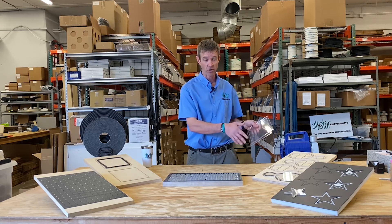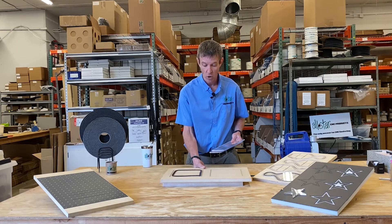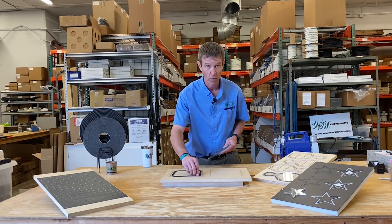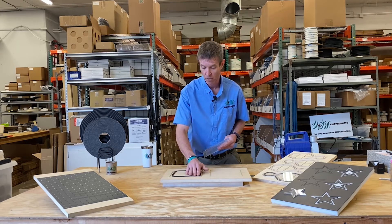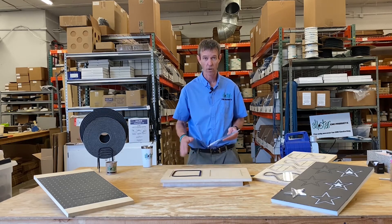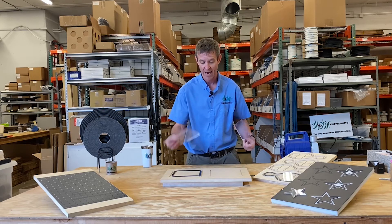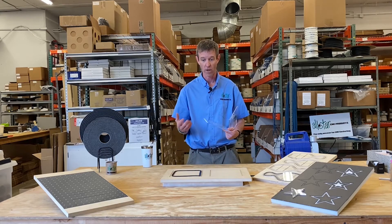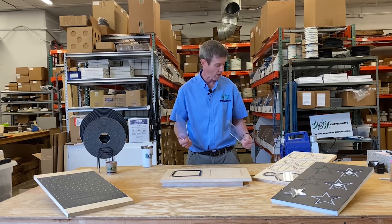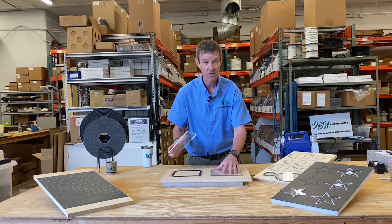For folks doing short runs and custom parts who don't have the time or interest to make a dedicated fixture, we talk about spoil boards. The quickest, best way to hold parts in a spoil board environment is our onboard gasket. Onboard gasket material is self-adhesive and sticks right onto the surface of an MDF spoil board. By placing it there, we change the whole science of the table — instead of a vacuum downdraft system simply holding the part with strong airflow, we create a true vacuum clamp by pulling air from the pocket the gasket creates as a seal.